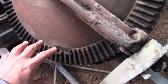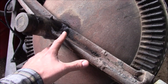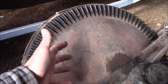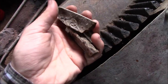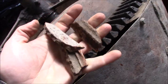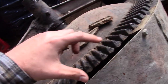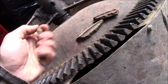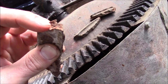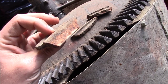This whole bottom piece is an integrated gear and spindle. There's no replacing it — this is basically the heart of the cement mixer. If that thing fails, might as well scrap it. These are the pieces of that cast bottom that broke out when I was chipping away at the concrete. Upon further inspection, you look at the amount of rust on the inside of the cracks — this has been cracked for quite some time. The old concrete was just holding everything together, like a band-aid holding the fingernail on.